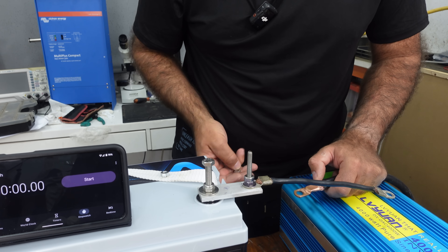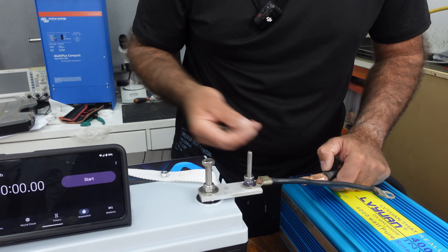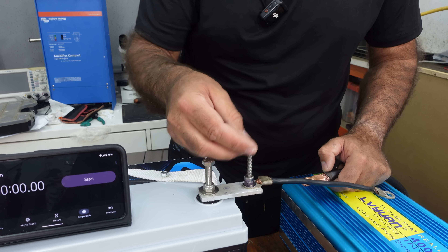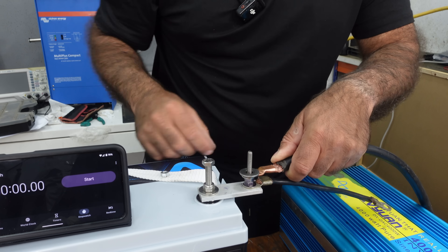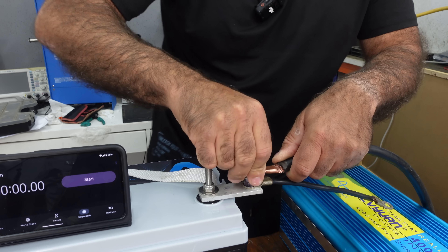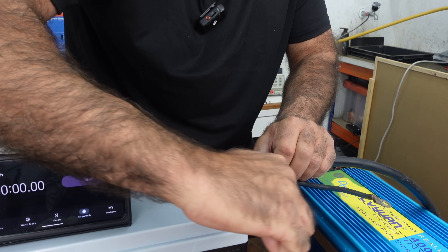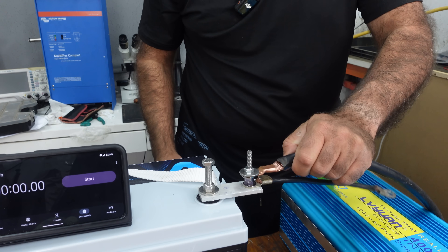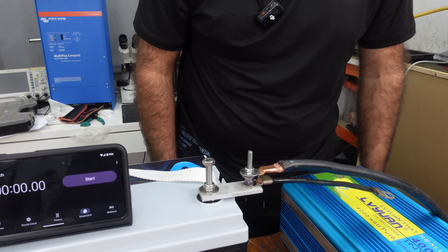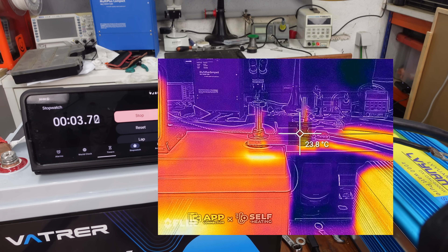One of those connections we should not do. Let's say I want to connect a new alternator and I look at the bus bar and decide to just put a washer and connect it on top like this. This is not the right size hardware, but for demonstration it's perfectly fine. I'll tighten it up real good — it's really solid; I can lift the whole battery and it won't shift. So let's test it and see what happens over another 10 minutes.